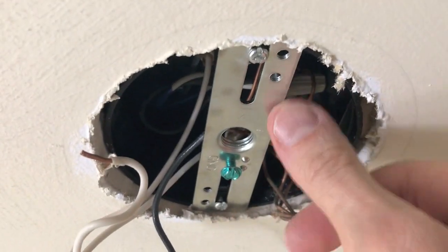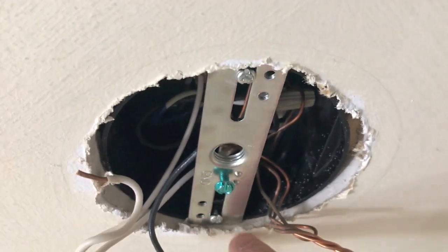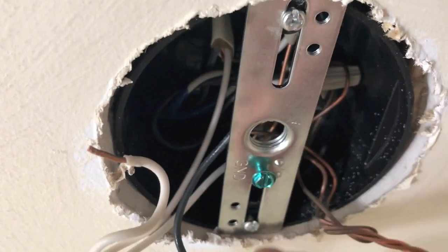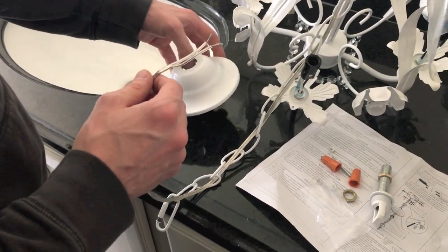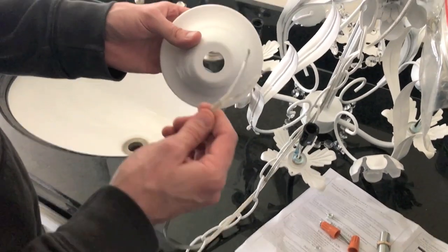The mounting plate is secured by both Phillips screws — one in the front, one on the rear. Take note of how this mounting plate is positioned in the actual hole: it is not overlapping on the drywall, it is up into and resting against the actual plastic casing inside the hole. This is a very important step and it's common to miss during installation, so let's get this right the first time.